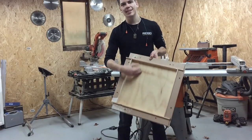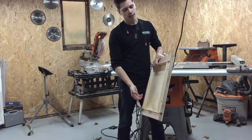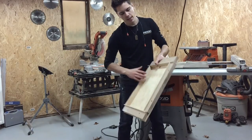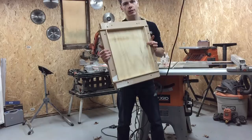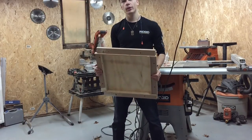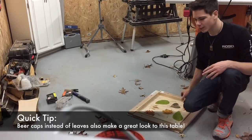The inside of the form is 16 by 16 inches. To do that, I screwed in the MDF cleats with one-inch drywall screws, then added finish nails — about two of them — on the inside. Now we have this solid base where we're going to cast the concrete.